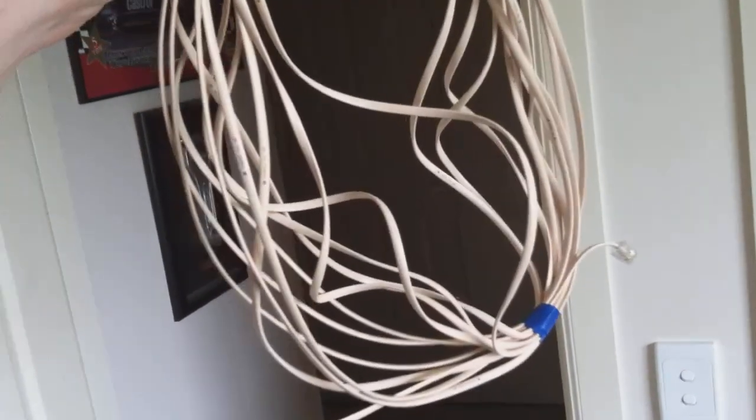And they're not twisted pair, they just go straight next to each other, like a parallel line. Get it? Parallel line. That's a frickin' antenna. Piss that off. And look at this. This one ran from one of the patch panel ports to that telephone up there. Same thing, but that's four core. Or still running parallel with each other. It's a big frickin' antenna. Fuck it off. Over. So, what do we do?